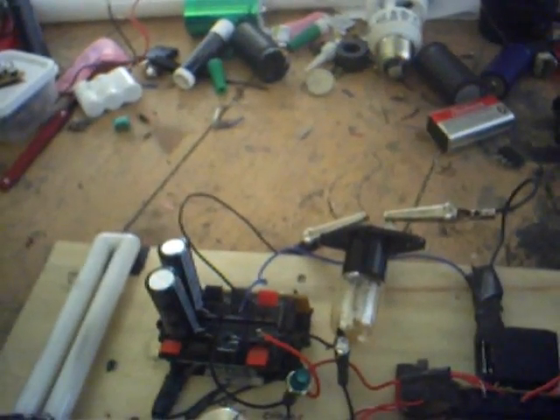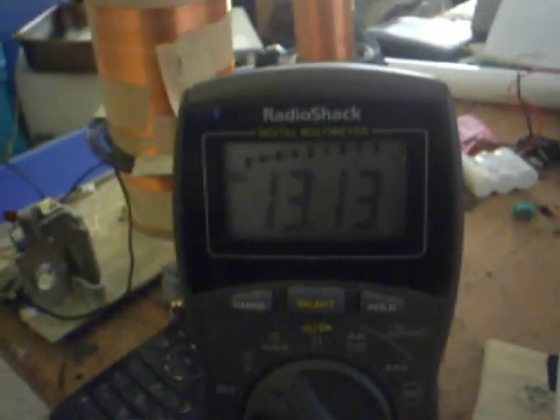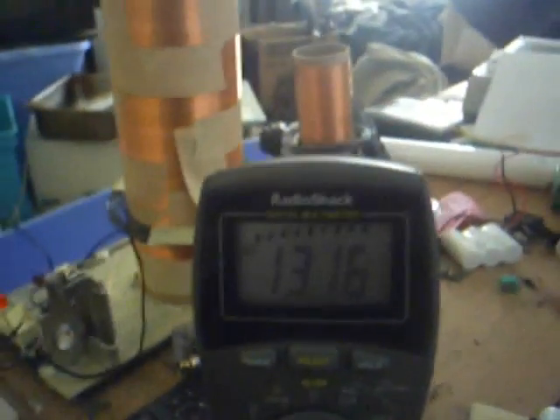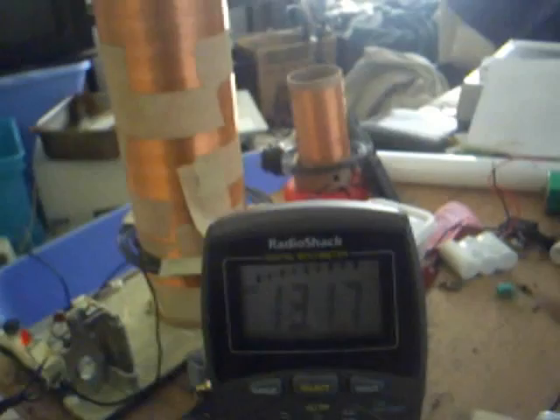That effectively gives me a cap pulser. Right now I've got no battery on there — I've just got this microwave oven bulb on there; I'm going to show that later so you can see the pulses. Right now I'm going to cut it on. It's in regular charge mode, getting about 72 volts out after the neon. I'm just going to show the rate at which it'll charge. The input is 12 volts, 130 milliamps with the regular charge mode.